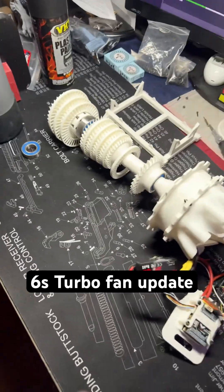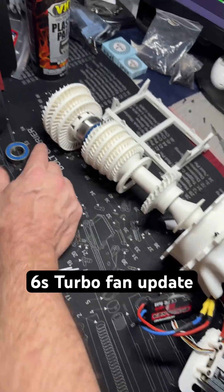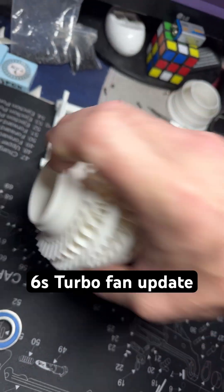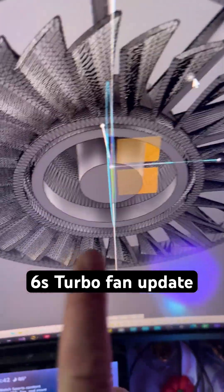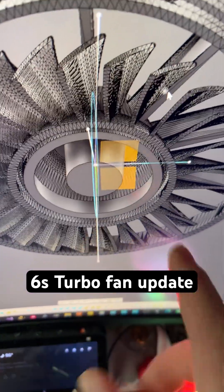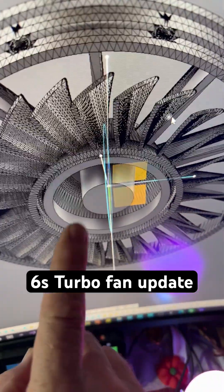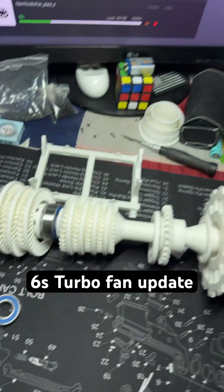As far as the front LPC main fan goes, it was just floating freely connected to this part right here — I didn't like that. So what I did is I made a bearing port for it, so a bearing sits in there, and then the outside casing goes through the center of the bearing and bolts to the outer casing, which will make the entire thing way more stable.